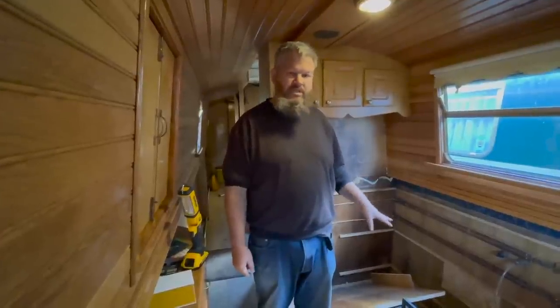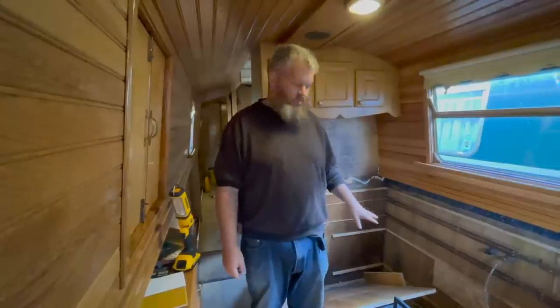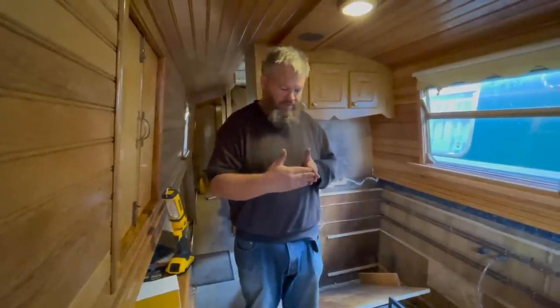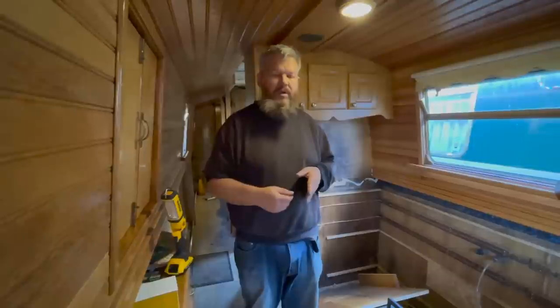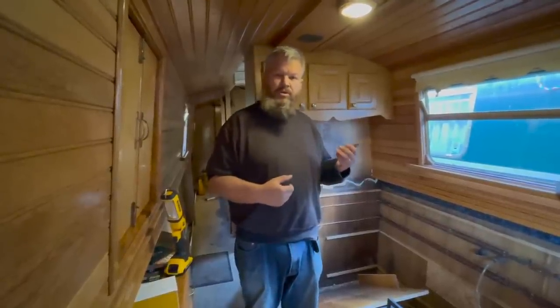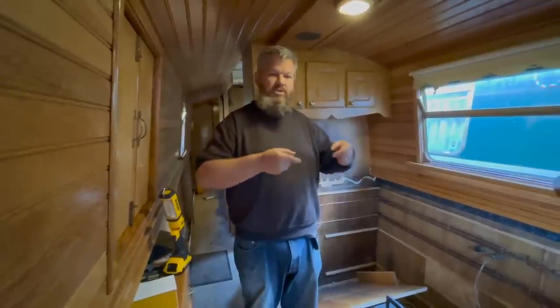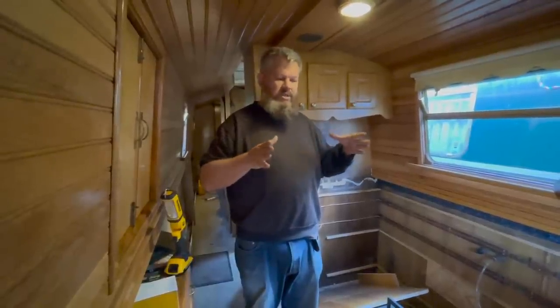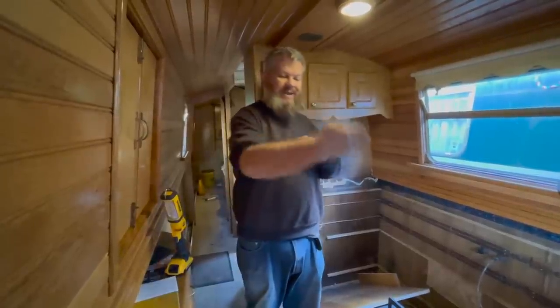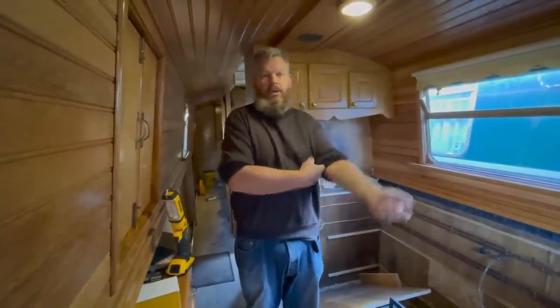In this area, we did see some damage where water had been soaking in for quite a while, but the area that was damaged just happened to be where the two angles of our counter met and where the water would pool. Unfortunately it caused the damage, but it didn't get to the point where it flooded up and was saturating over the steel beams, which would cause the next panel to break. So basically, we just ended up with the center of a piece of plywood that has rotted out, but at the edges, we've got a nice solid piece of metal, and when we've cut it back, we've got clean wood that hasn't got water damage out to those edges. So we're basically just lucky.